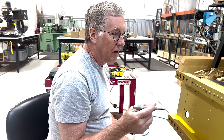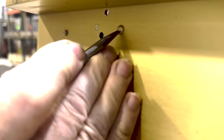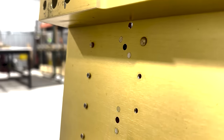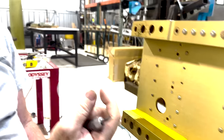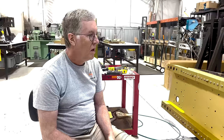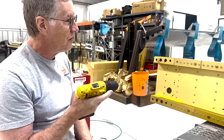We are going to do a demonstration of removing a dome head or AN470 rivet. The first step is to emphasize the little dimple in the center of the rivet with a center punch. This is an auto center punch that just involves putting it into the dimple and pushing. If you don't have that, a standard center punch with a small ball-peen hammer could be used. Now we've got a rivet that has a center punch on the center of the manufactured head to help us stay centered when we're drilling.